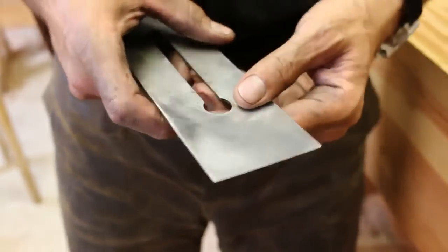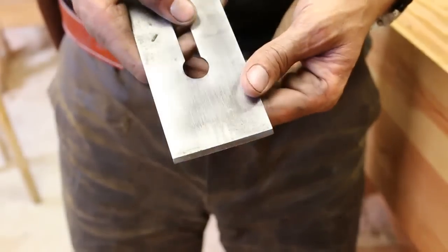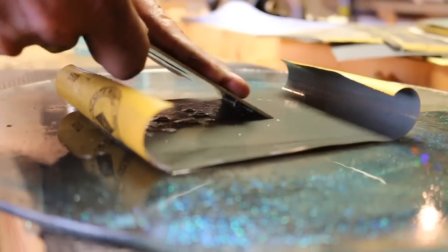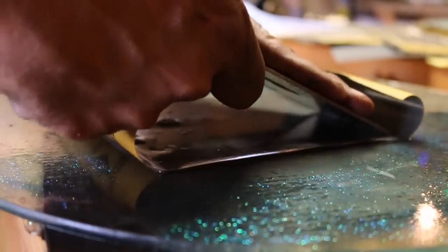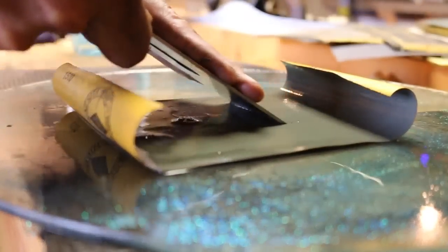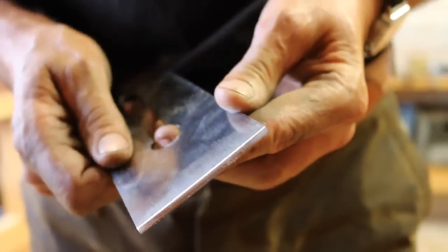So I'll finish this off with a 1500 and put a polish on it. We'll go back and just touch up that edge. And then I'll show you how leather is your friend. We can just finish up our polish by dragging it backwards, rotating it up until we feel that resistance from the edge. And here you can see that 1500 polish on there.